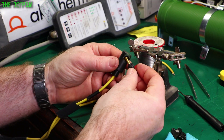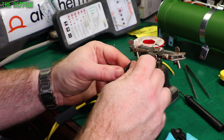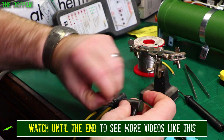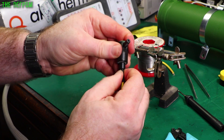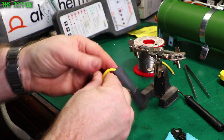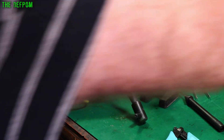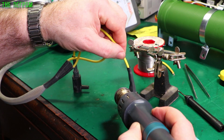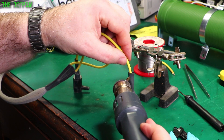I've just pulled the wire back through and put this fitting back on again. The sizes of these should still be okay because I resized these connections last time — if you don't know what I'm talking about, check out my previous videos about the sizing of the connections. Get that into the housing. That's good. Heat shrink on, shrink it, then I'll test it and it should be good. I'm 90% sure it'll be good. This heat shrink, although it's much thinner than the original sleeving on here, is actually much more flexible, so it works a lot better as a strain relief than the original stuff does.